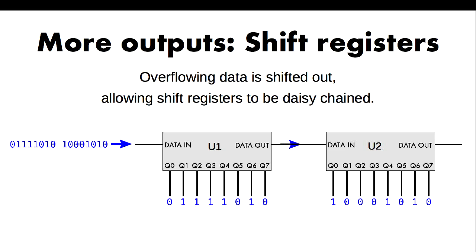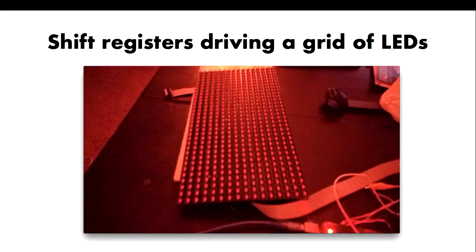On its own, a shift register is great — it has eight outputs so you can plug LEDs straight onto those outputs. You can get a seven-segment display and attach it to a shift register and very quickly and easily drive digits. But if you combine shift registers with multiplexing, you find yourself with many, many hundreds of LEDs fairly easily controllable with a handful of bytes fed through shift registers.